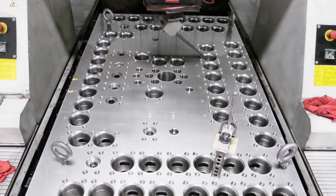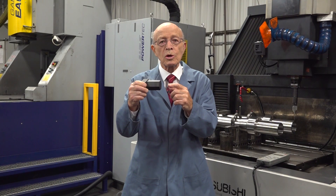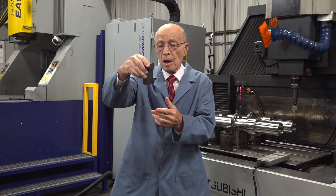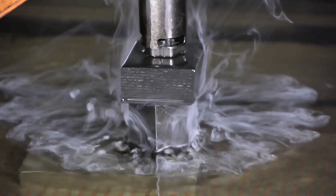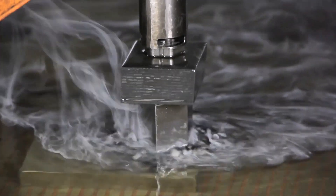A customer wanted to connect two cavities of this large valve, and the electrode went in at an angle. Sinker EDM also works one spark at a time, but it works at the bottom so the entire surface is sparking. We're going to watch a video of this electrode beginning to EDM a part. Notice the up and down motion of the Sinker EDM — the electrode does not touch the part. The sparks are jumping rapidly from the electrode to the part, and to remove the eroded particles and bring in fresh oil, the Sinker EDM keeps pecking along, creating hydraulic pressure.